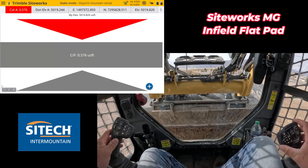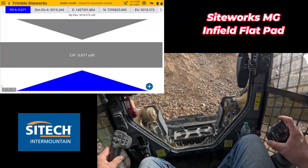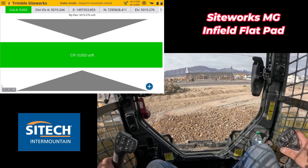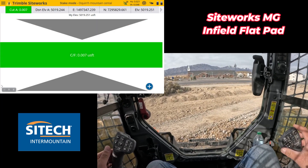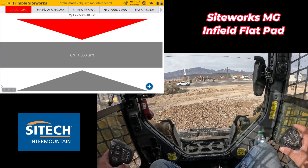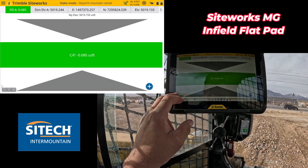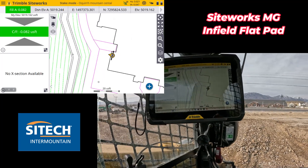It's pretty handy and useful because I'm still using the actual bucket on the machine, so I can move the material around myself — I can manipulate it, move it, and still have all the grade that I need. Grader blades and box blades are great, but you can't really move material unless you detach that piece of equipment and put your bucket on. So this is a pretty handy tool. Once I get up on it one more time, I'll touch down and be like — okay, there's my grade. I'm about a cut of half an inch, which is totally fine because it's going to roll down. Then I can come up, move up, touch right there — okay, there's a fill of about four hundredths. You can change your screens around to whatever you need. I've already established a grade up there, so now I can just continue to fill and fill and fill. If I wanted to change these screens back, I can flip to there and reference any building pads or anything I need to.